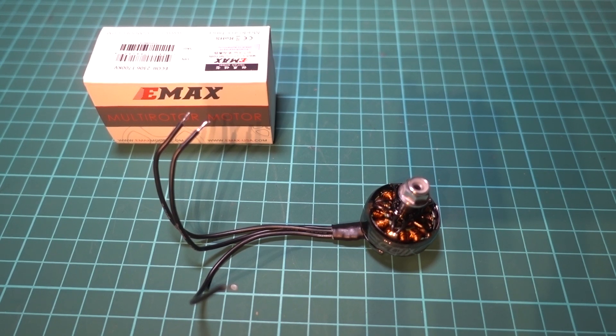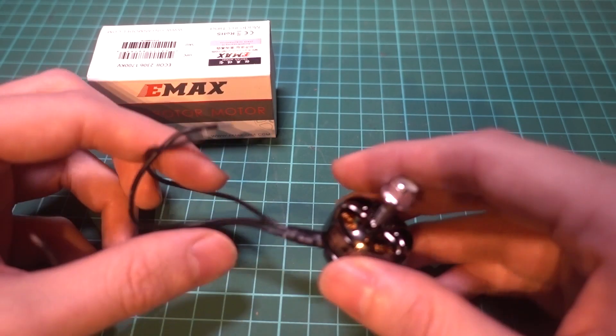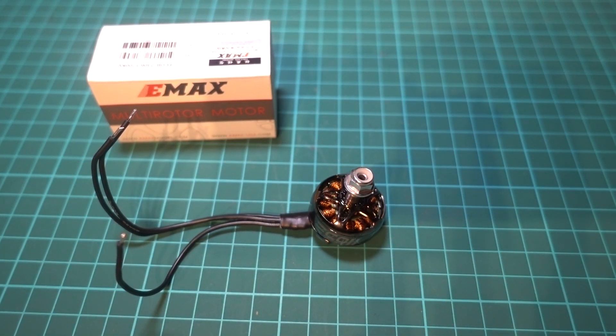Next I'm going to talk about what brushless motors to choose for your 5 inch quadcopter. Some people call them AC brushless motors because an electronic speed controller converts DC or direct current into a waveform, however their official name is a brushless DC motor or BLDC for short.